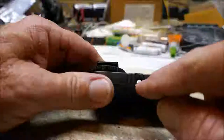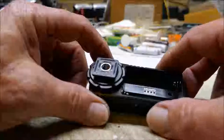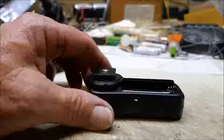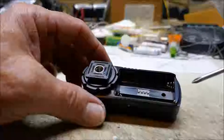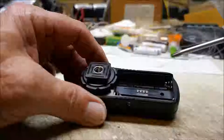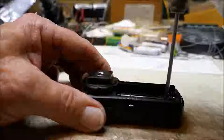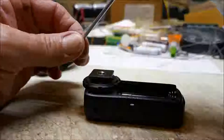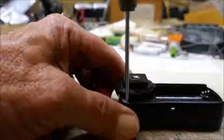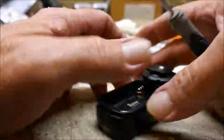I've already pre-drilled a hole on the side so we can exit our wires out. I'm going to take this apart because I like to remove the tripod mounting base to give this a thinner profile in the build case. Once you have the battery cover back on, you can put some velcro there to stick this down inside your case. I'm going to take out the screws in the center and then the couple of screws in the corners.